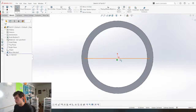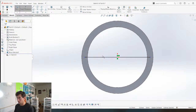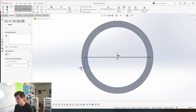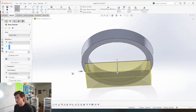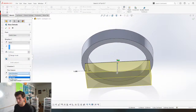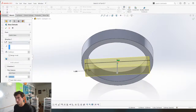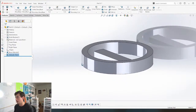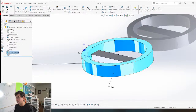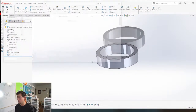So this, I'm just gonna make a crossbar. This is gonna be the midpoint, midpoint, boom. And we can just give this a random orientation like that. And we can extrude that now. And that I'm gonna extrude as a thin feature, give it a mid-plane function of, maybe we'll go 5. We're gonna go the other way and we're gonna go like 2.5, boom. And that might not be thick enough. Actually, yeah, it's not thick enough. This needs to be like 7. So that way it's going to mesh. I'll show you guys where it's gonna mesh, but.